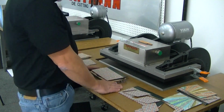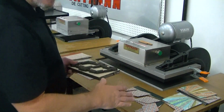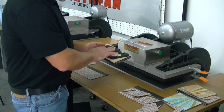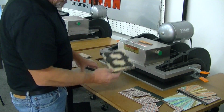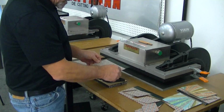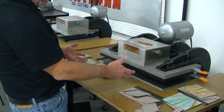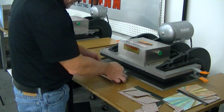Now, as far as the machine goes, this machine has 120-inch capability, so that means you can have 120 inches of die blade in here. So you could possibly go up to about an 8-up cavity die if your material is large enough to cover. And even if it doesn't, you have smaller material. If you have an 8-up die, you can lay it on 2 positions and then still have the other ones that aren't covered and still cut. It's not going to hurt the die or the machine or anything like that without cutting anything on it.